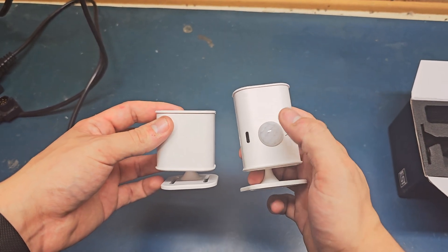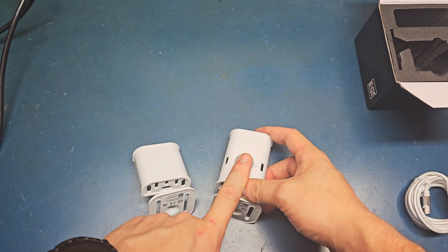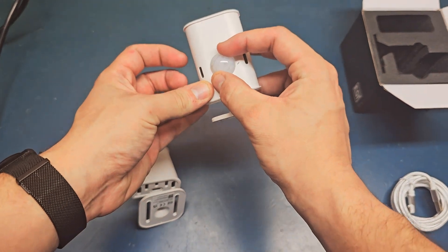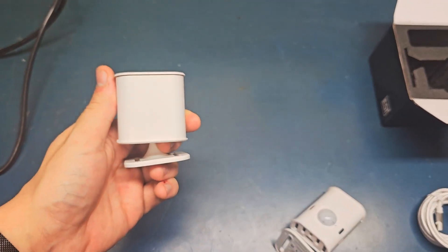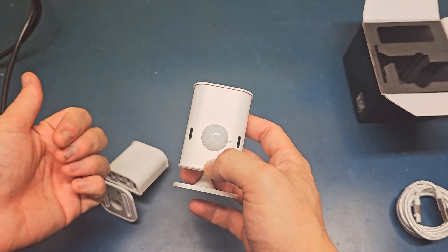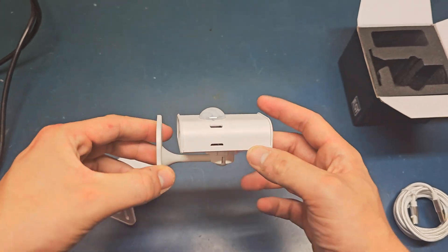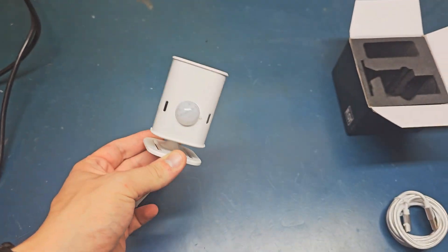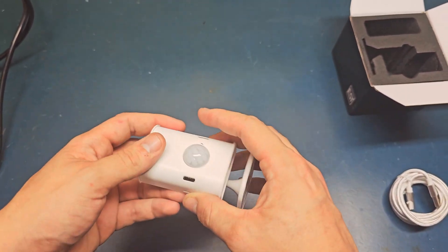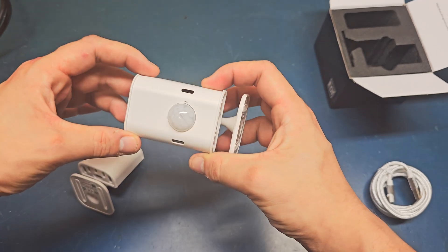You can see they are similar, but the one is a little bit bigger, mostly due to the addition of the PIR. So alongside being millimeter wave sensors, the Everything Presence 1 has a better ranged sensor in it, as well as the backup of the PIR infrared detector. While the Everything Presence Lite does just millimeter wave and ambient light tracking, the Everything Presence 1 does millimeter wave, infrared PIR, ambient light level tracking, as well as temperature and humidity. So in theory, this is the only sensor you should ever need in most of your rooms — unless you need to manage a leak or something like that. But in terms of automations based on temperature, humidity, or motion, this should in theory be the only sensor you ever need.